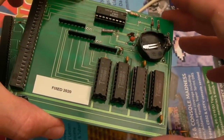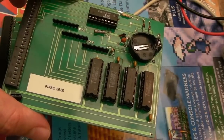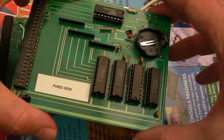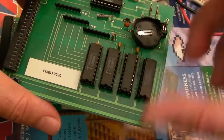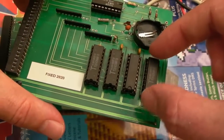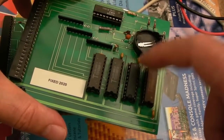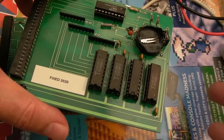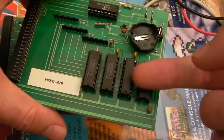After the parts you've just seen, I used it for about six months and it was a bit erratic. Occasionally I'd get weird things going on, re-seat the RAM, and it would seem fine for a bit then start playing up again. Ultimately it was that one chip. I got some more of these — 41256s or whatever they are — and swapped them one at a time. As soon as I hit that one, it started working. Corrosion can damage pins when the board is powered, and these chips can also just fail from old age.